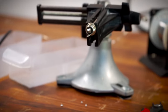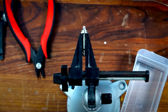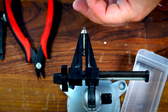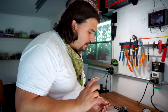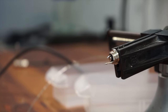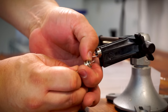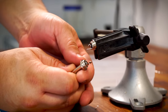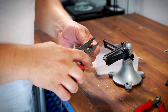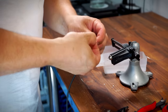I'm leaving that hole open because I'm actually going to feed the shield through it. The issue with these is that the housing is so small that I can't leave very much exposed cable at all if I want to use the full benefits of the strain relief. I've also bent down the tip slightly — comparatively, a new one has it sticking straight out. I'm bending it slightly down to give me a nice angle when I go in to solder. Now I'm going to strip off very little — less than a half inch, probably right about a half inch. I'm going to braid my wire.